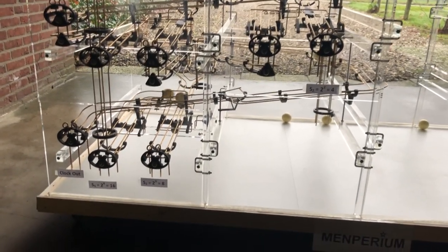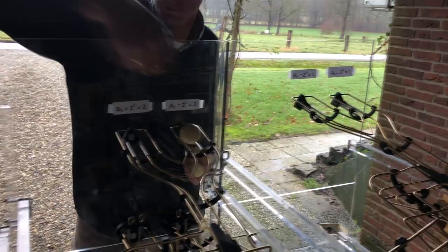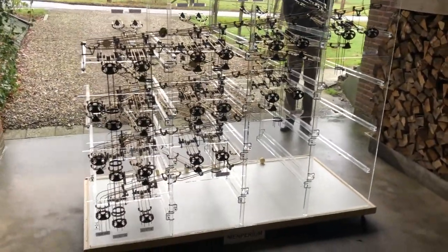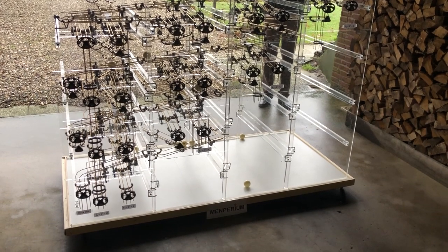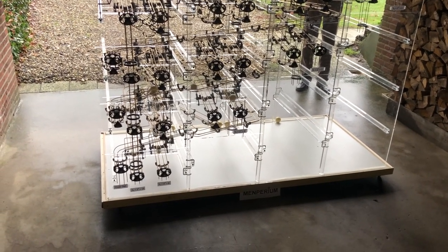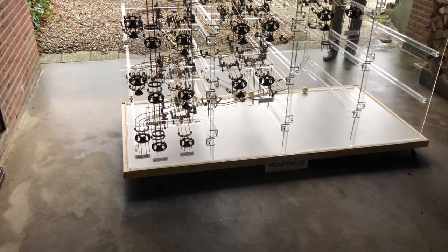And I will add 15 plus 15. Finally, the overflow in the last stage will make the output 16. Now I will add 15 plus 15, the highest numbers that can be added. You see a waste and an overflow in all first stages. The machine needs to be clocked. You see 16 already coming out. 2 is falling. 4 and 8 will come as well. So 2 plus 4 plus 8 plus 16 is 30.